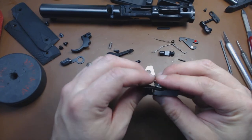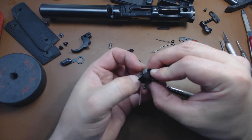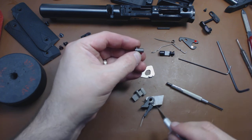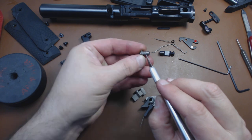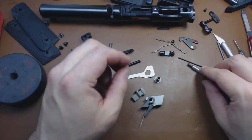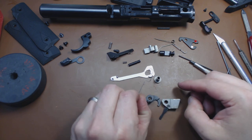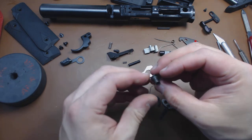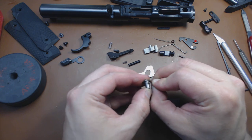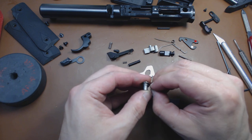So the spring itself is the bushing retainer, and I'll go ahead and slide that the rest of the way out so you can see what I'm talking about. So in our bushing here, that little tiny wire spring has a coil, and that coil is going to get lodged between these two rims, and that's going to act as a retention mechanism for the whole thing, which is great. Of course, once it's dislodged, as we have here, everything can come apart. So here we can see the crazy spring and its big coil, and we can see how it really just barely squeezes past that. So it's kind of tricky getting it on and off, which makes it a decent retainer. So that once it's in there, you know, it's not going to wiggle itself off. You really have to line it up and pop it off.